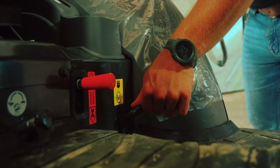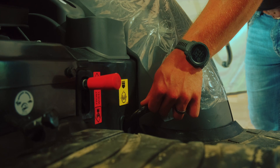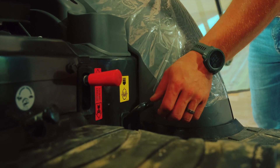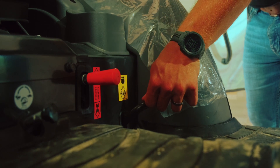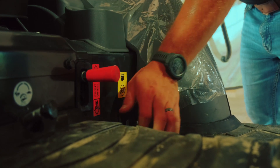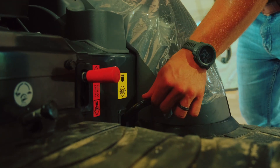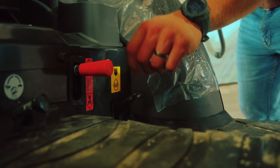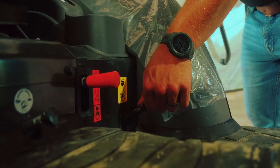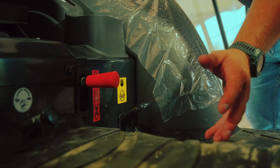This is our differential lock. The differential lock is to be used when you're in situations where you need maximum traction and less steering. When you engage the differential lock, it locks both rear tires together, but it does inhibit your turning ability quite a bit. You push down on it — again, you may need to push forward on the hydrostatic pedal to get it to fall into place. You want to engage both the four-wheel drive and the differential lock when you are not spinning, so stop what you're doing, engage both of them, and then continue.